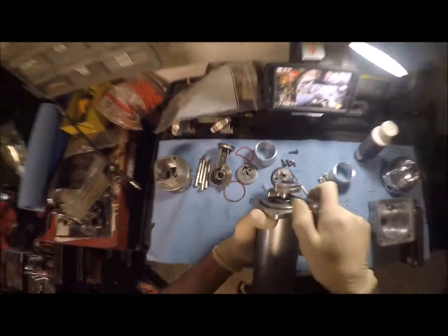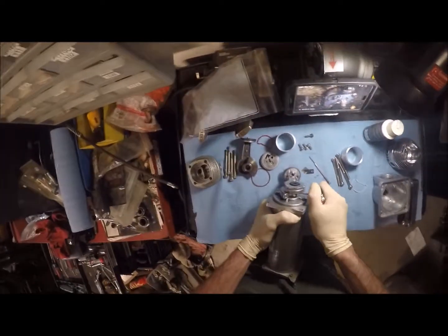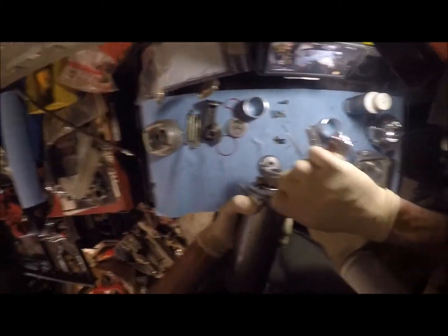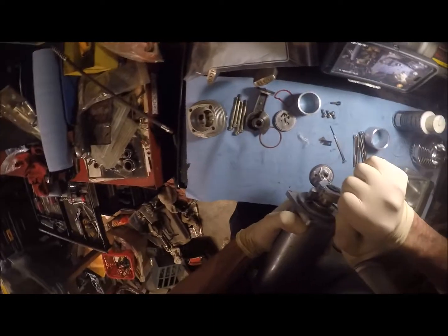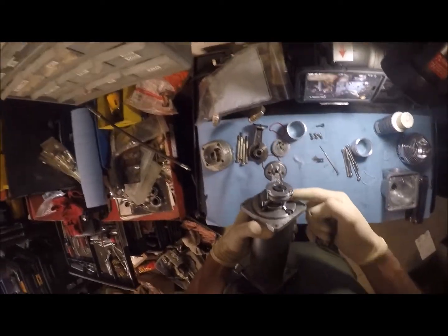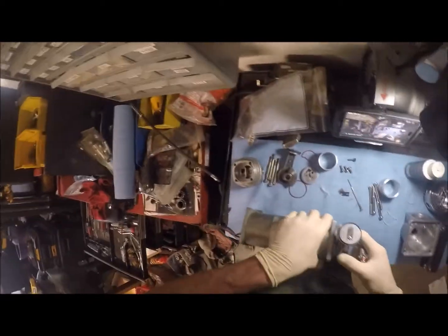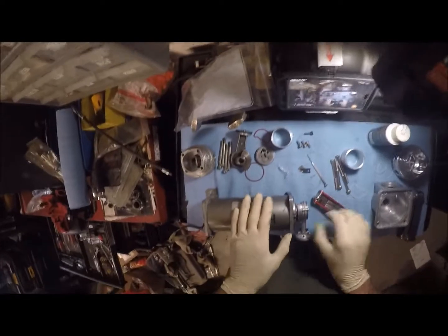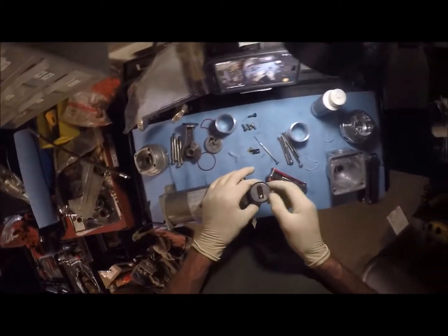Don't be afraid to torque these. The last thing you want is that actually slipping. These are under a lot of vibration, so you don't want that to slip on you as it's spinning, because it will turn and jam itself literally on that shaft, and it's an act of God to take that apart. Okay, so that part's in.